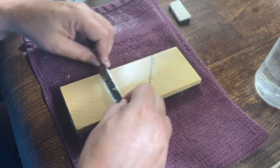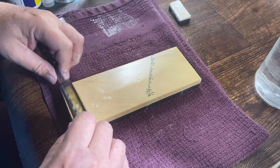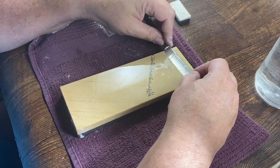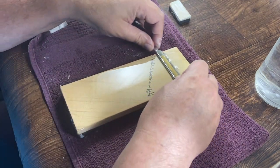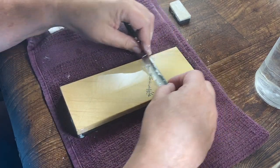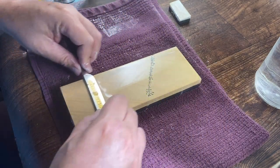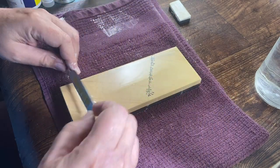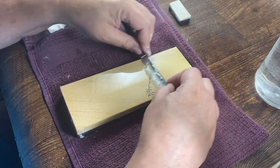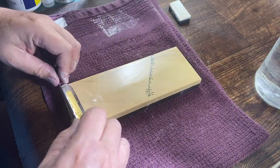If you notice, I'm not quite at clear — probably two more dilutions. But if you notice that the water is riding up on the blade — somebody had asked me about undercut — that's what I mean by undercut: the water is being pushed up on the blade, so the blade edge is almost to the point where it can't go any further on the coticule. It also shows me any areas where the blade may not be even, because the water should be coming across fairly evenly, and that will also tip you off on geometry issues and whether or not your stone is flat.